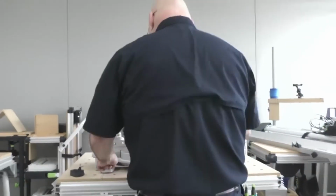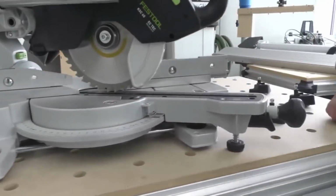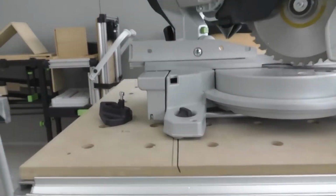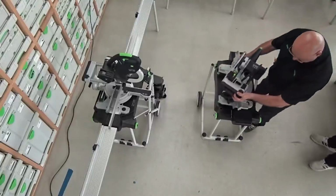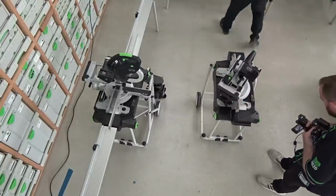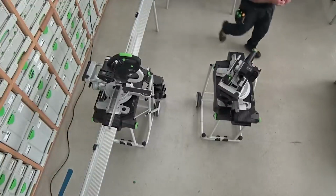When you put these in, these holes right here, Chris, come here, here, and here, will fall into the matrix of the 20mm holes that are drilled 96mm on center, because 32 plus 32 plus 32 is 96. Okay, one of these days I might do some math, Mr. Metric. So I'm going to line those holes up right on there like that.